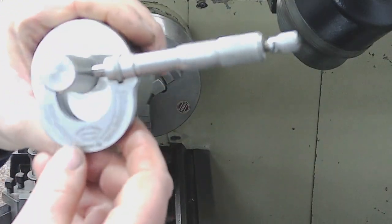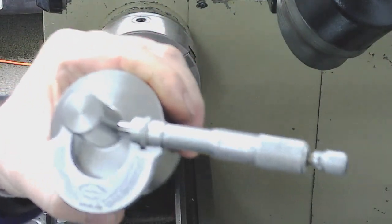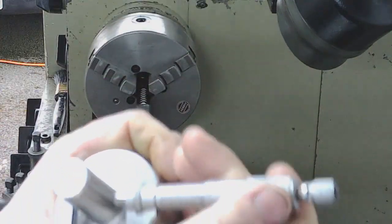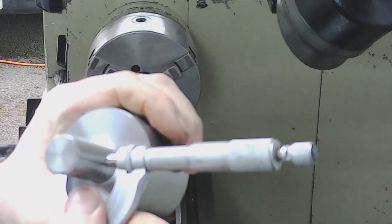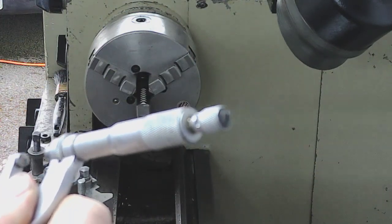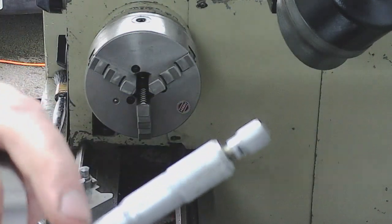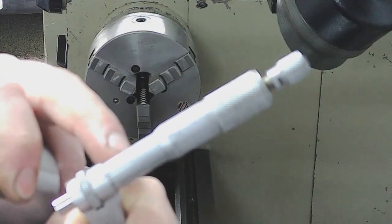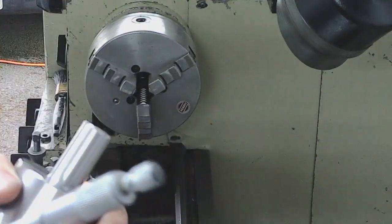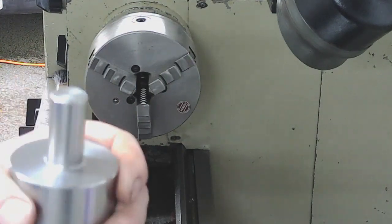Right, here we go. This is cooled down now, guys. I don't know whether this is going to show. It's not, unfortunately. But I've got my better micrometer out, and I've just checked that now. 20mm is 0.7874, and that's a tenths micrometer, so it's got the graduations on the barrel there for tenths. I'm measuring 7875, so that's that method of balanced cuts for semi-finishing and finishing.